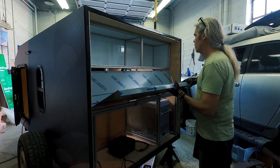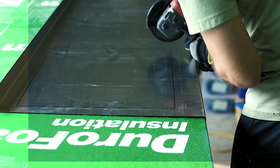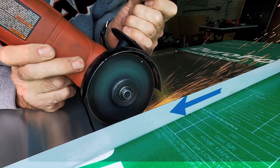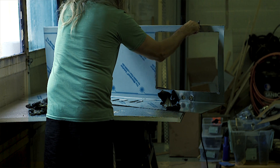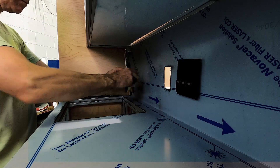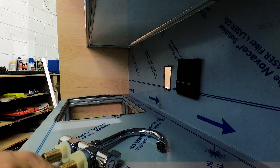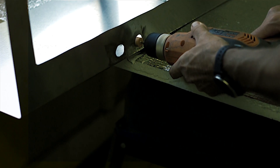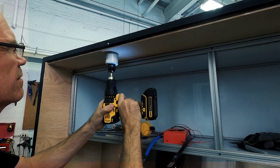Here you can see I'm test fitting the stainless steel — it's still got the plastic on it. We test fitted it about four times and I got the measurements with Jen to put the cuts in for the sink. It's quite a big square stainless steel sink and I think it looks really impressive. I just used a cutting blade on an angle grinder, took my time, and was very careful cutting it out. Then I peeled off the plastic and here you can see I'm aligning the tap. I did have to go back in with some Dremel bits to widen those holes to make sure I had connection room for the lines to connect hot and cold running water.